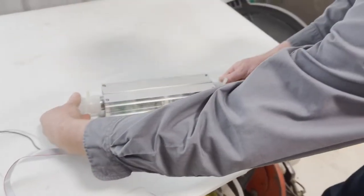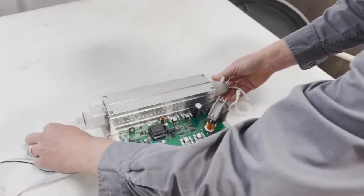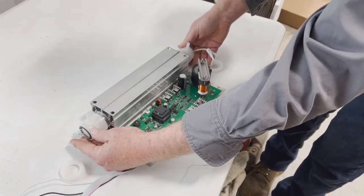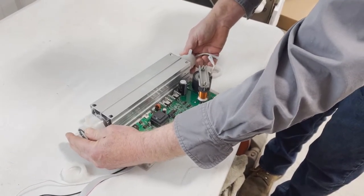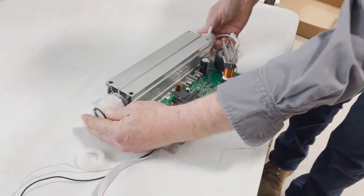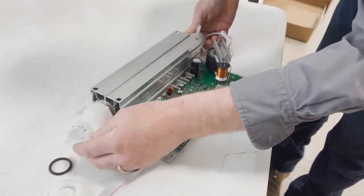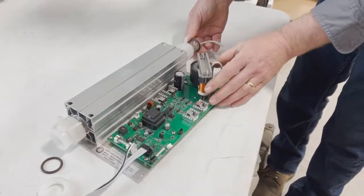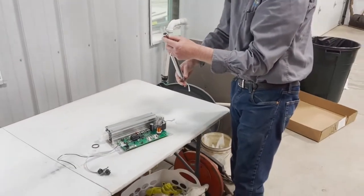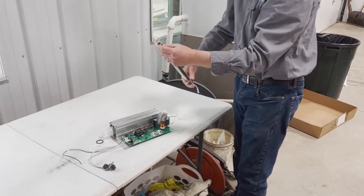It's quite easy to take these apart. Normally these would be hand-tightened, and there's a viton o-ring that seals the space. If they've been used for a while, it's going to be a little bit tight, so push it back and forth. If you put a little bit of soapy water on here, that really helps loosen it up. Push it back and forth and the viton o-ring will come off. Then on the other end, just pull the quartz dielectric out — and there you can see the conductor on the inside with a spiral of wire.